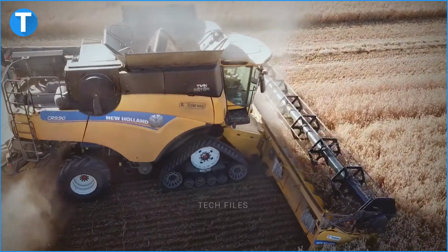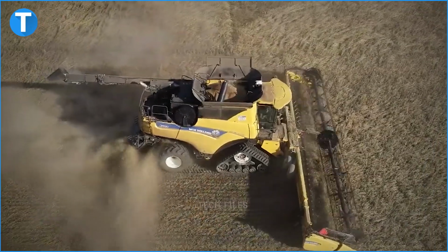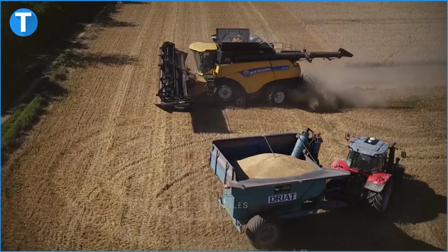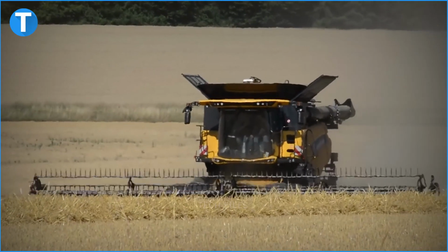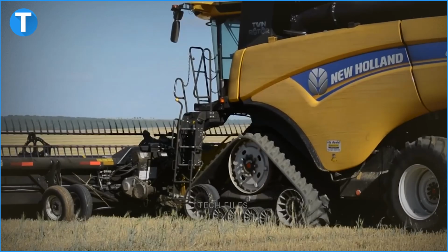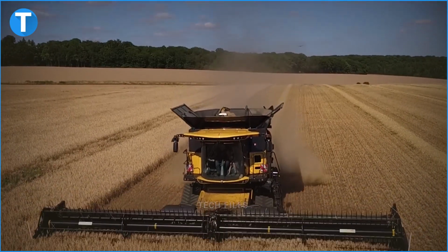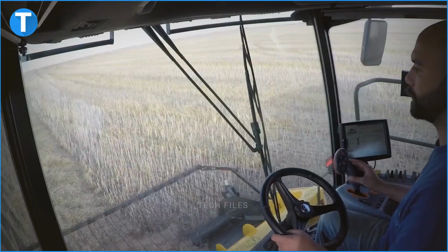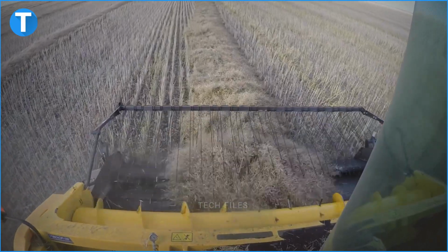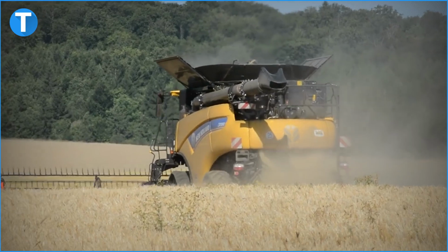The New Holland CR990 machine is a combine harvester with an FPT engine that powers it with up to 420 kilowatts or 563 horsepower. The dimensions of this machine are 3.49 meters by 9.97 meters by 3.96 meters. This New Holland model comes with an air conditioning system, chaff spreader, and a cabin to enhance the conditions of use. This particular model has also been sold without air, hillside leveling and all-wheel drive as of 2017.